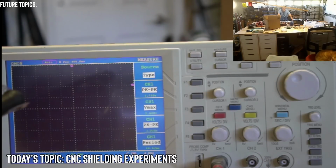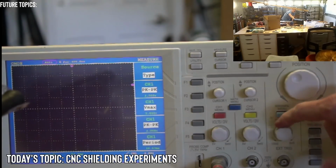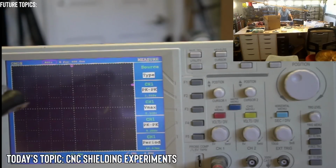The knob under the blue button. Yeah, this is the one. Right, okay. The 0.1 UF ought to do the trick. I'm still a proponent of that capacitor. We can also do both, but I can also try another 0.1 UF. Let's do the 0.1 UF first. I feel like I'm doing this all over again, but it's worth the time, I think.